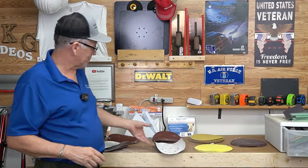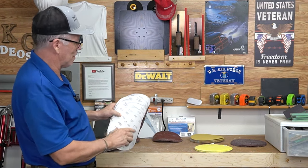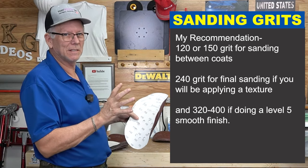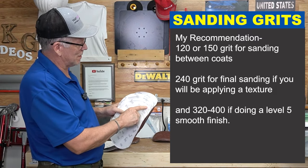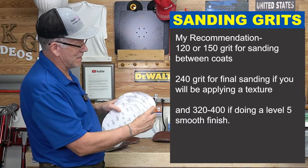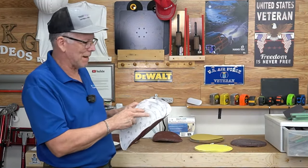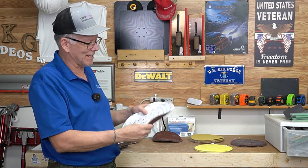That shows the whole gamut: 80, 100, 120, 150, 180, 240. Sometimes I really want 240 but only have 180. If I were to recommend a nice selection for you guys, it would probably be 120 and 180, or 120 and 240 — you could get by and do a whole job with just those. But if you're doing this very much, you might want some additional grits. A lot of power sanders like the Wand power drywall sander come with a whole variety, which is where I got some of these other grits.